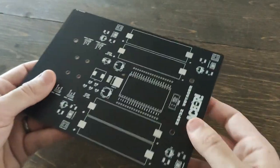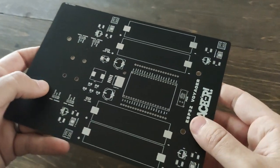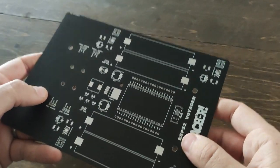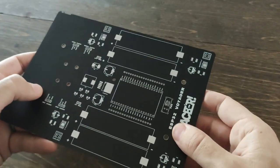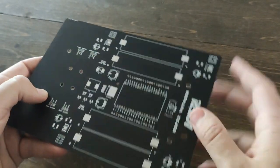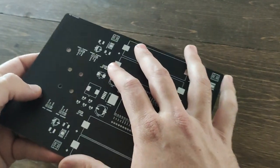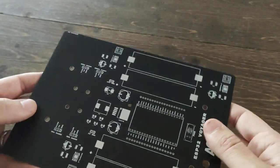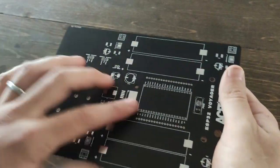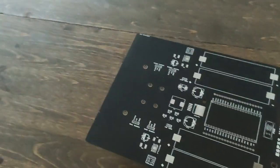With those four cells we're dealing with about 16 volts, depending on how fully charged your batteries are. That means we have a ton of power. Now, while these DC motors are meant for 12 volts, it's really not a big deal. With that 16 volts going into our motor drivers, we have a ton of speed, a ton of power, and it makes for a really, really fun robot. The ESP32, as well as our servos, cannot handle 16 volts — that goes without saying — so I wanted to include some buck converter circuitry.